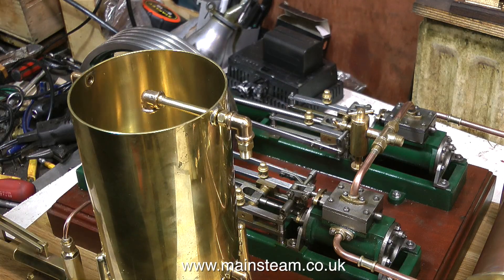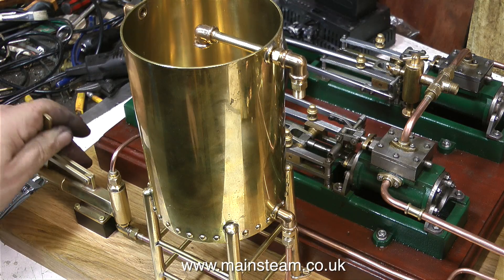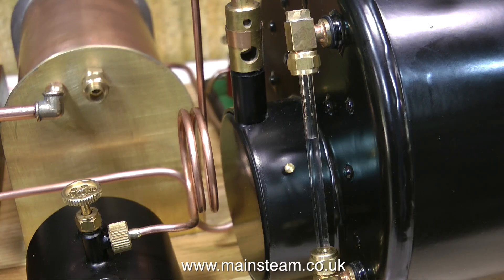Time now to test it and see if it works. First of all I'm adding some water to the tank. By the way, the outlet pipe from the pump to the boiler — I silver soldered it after bending it and forgot to press record, because sometimes I'm very incompetent in the camera department. As you can see the water goes up the glass very quickly, so the pump is working fine. The next thing to fit will be the Stuart Models HP6 boiler — featured in the last episode where one or two leaks were detected, but it's okay now, all the leaks are fixed. Thanks for watching and I hope you found it useful.